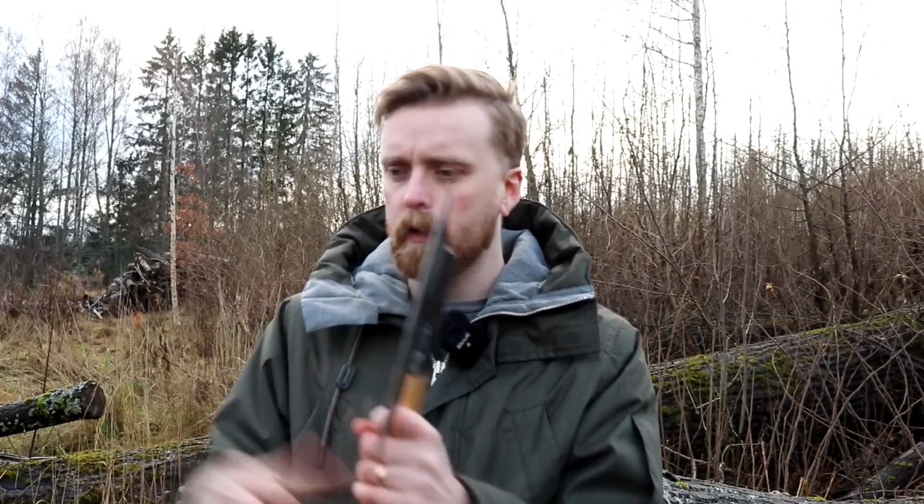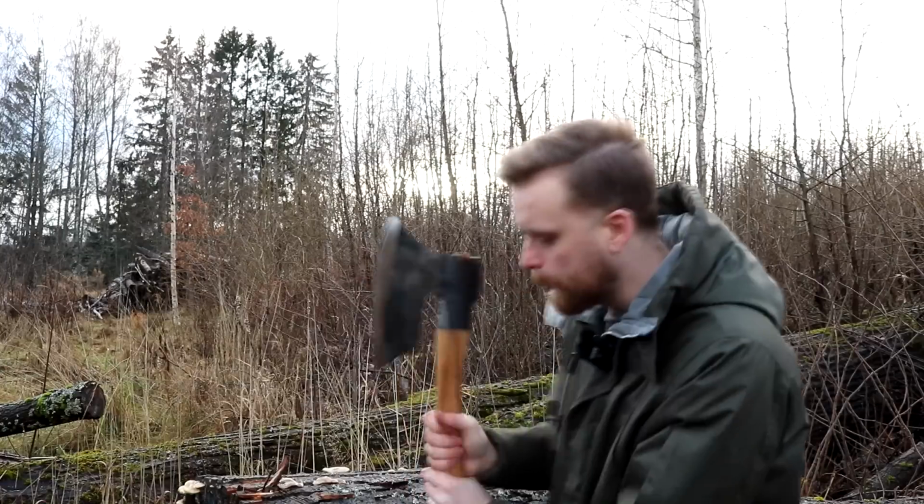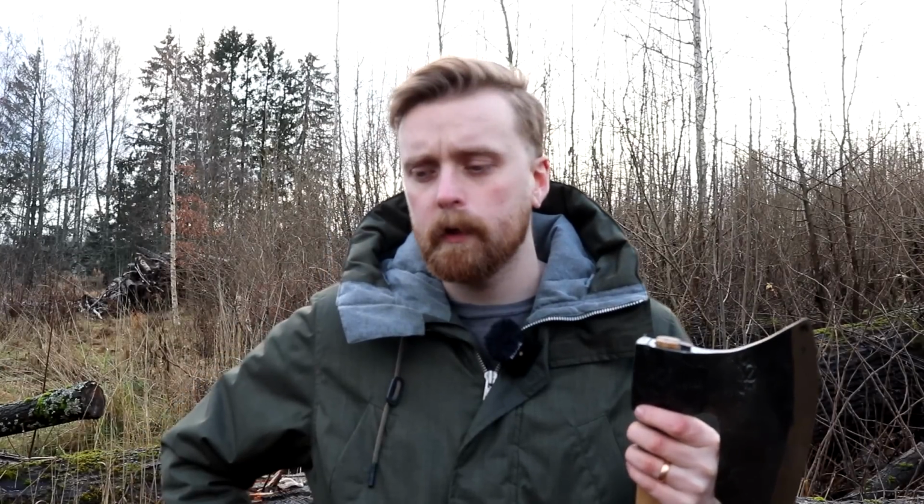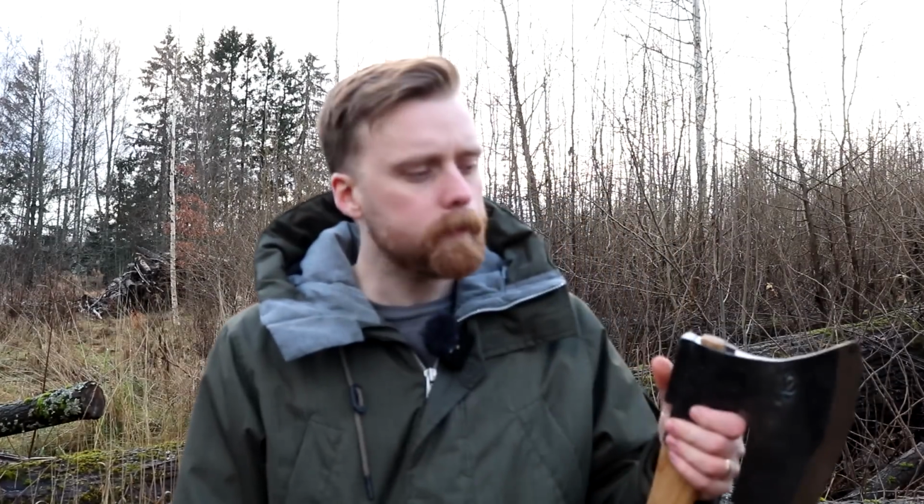However, there are also regular double beveled hewing axes. This is one of those, and my friend's axe was also one of those. The idea there is that you can have a straight handle because the bevel has a radius to it, so that if you're cutting with the bevel, you are automatically standing outside of the log, because of the radius of the bevel. So that is one way to do it. I don't know exactly the history behind the two bevels, but that's just something that I thought of, and since he's doing it a lot, I listen to him.